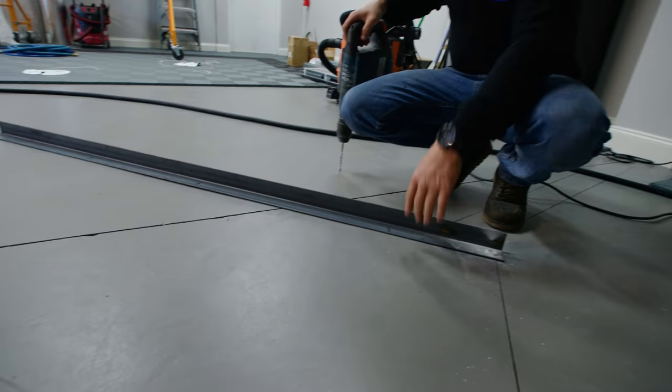All right, so we are done with pulling concrete out. That's the hard part's done. Everything's sawed. I cleaned up all the corners. Next step, on the next video, we'll probably show excavation. So I'm gonna have to take this soil down roughly 4 to 5 inches to make room for the concrete, which is gonna be down below grade, below this grade.